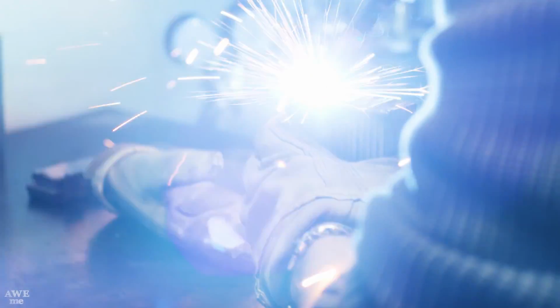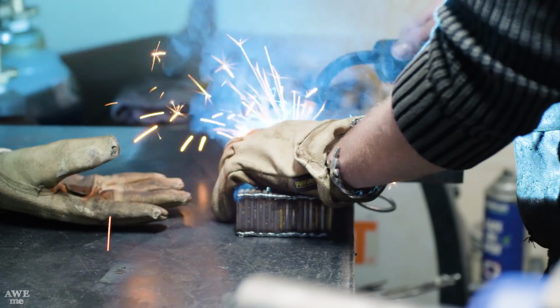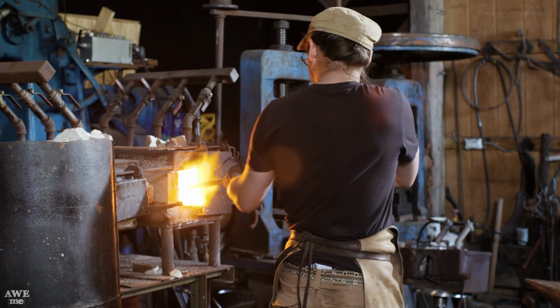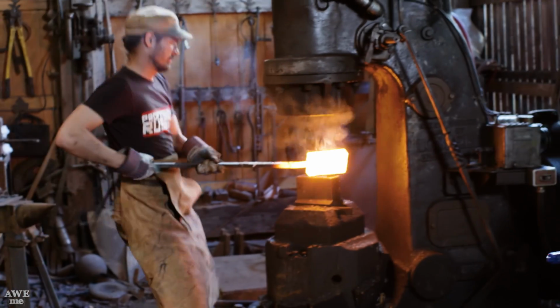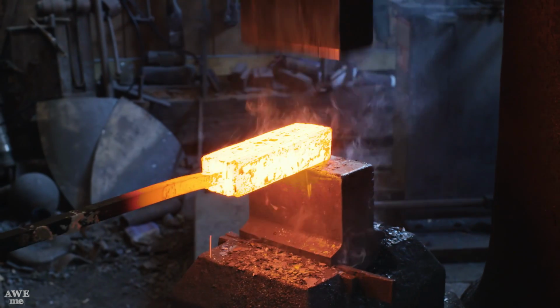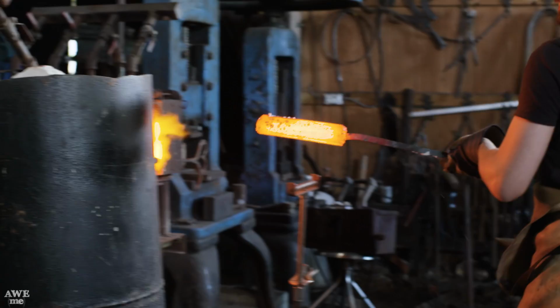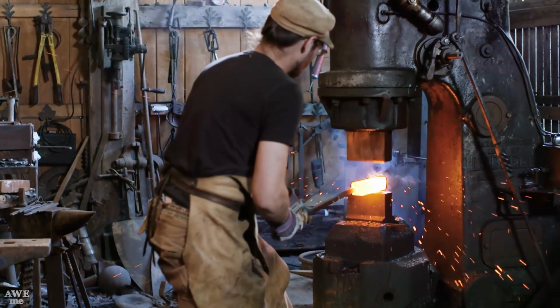After doing the initial weld, you'll often see Ilya hot cut and fold several times to get our desired layers for our pattern on our blade. In this case, we want to leave those layers nice and bold, so he's just going to get them welded and start drawing them out to the bar. Now we need about 52 inches of total bar so we can cut it into 7 different sections, do the twisting, and then put them back together.